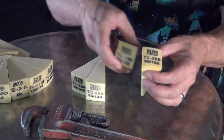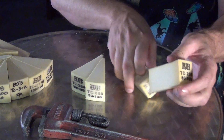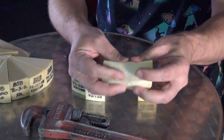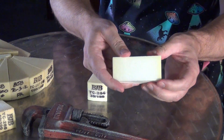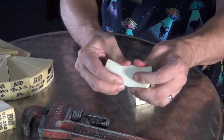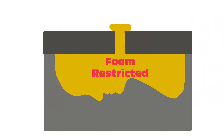To give you a good visual on the way that works: the 50A to 100B on our TC-266 cushion foam has really good compression, but you can feel it is slightly firmer. Whereas the one mixed to 30A to 100B is noticeably softer and a little bit denser. On the TC-284 with the 50 to 100 ratio, you see it doesn't have much give at all but has a really nice skin on the surface and a little bit of flex — ideal for padding applications and props where you want a really nice skin. The TC-284 mixed 30A to 100B gives you a little bit softer part with a little more give, but it is a denser part. The best way to get a good skin is to put those into a mold where they're compressed a little bit and build up pressure against the walls.